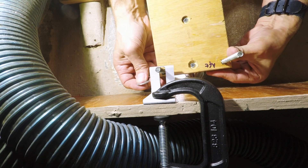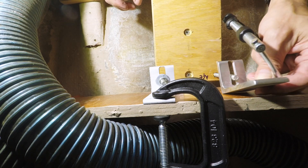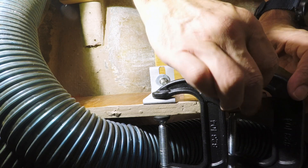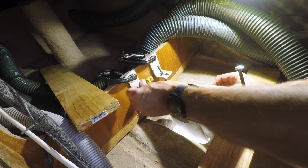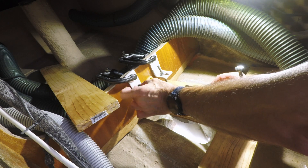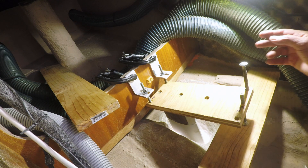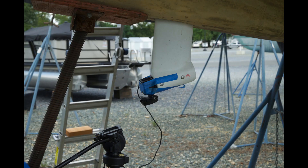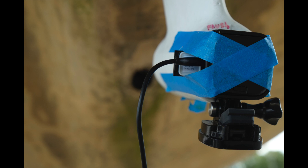From the inside, I mounted the strut with a three-point support jig I made out of plywood, held to the bulkhead with a pair of C-clamps and custom L-brackets. Next, I wanted to course-align the assembly. For this, I mounted a camera on the bore of the strut, connected via Wi-Fi to my cell phone. This allowed me to adjust the strut attitude while effectively looking down the bore of the strut itself.